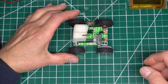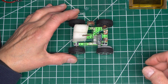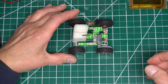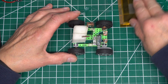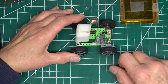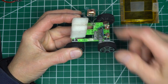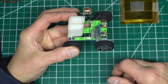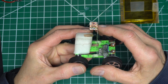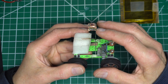I'll take a minute to show you how the eBay solar car featured in the first video was further modified to accommodate the 2-cell higher voltage battery. I removed the 2 stainless steel clips used in the first version and added 2 copper contacts on the ends of the spring wire supports. The contacts were made from 2 pieces of thin copper sheet that are soldered together.